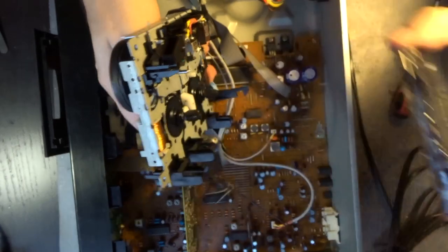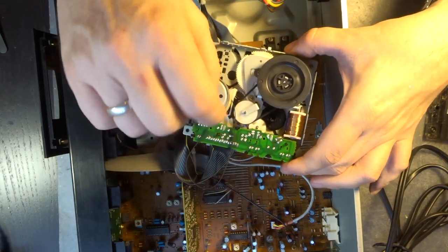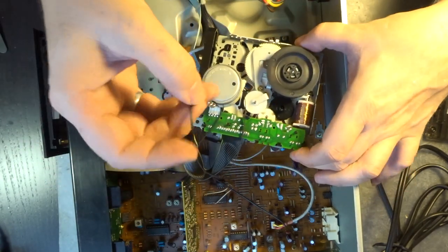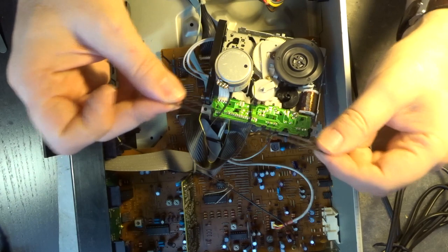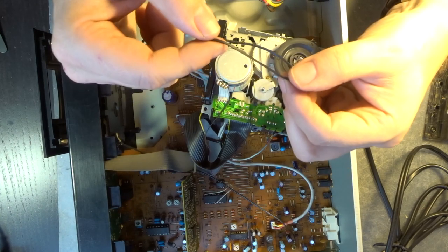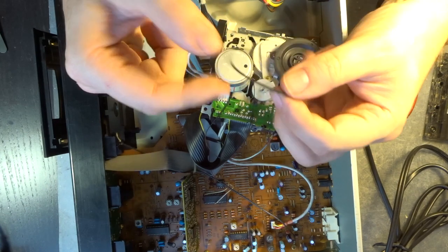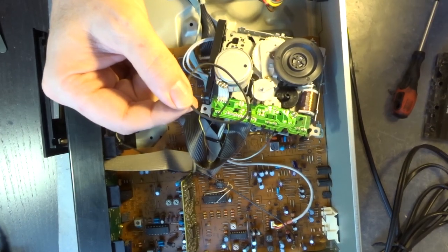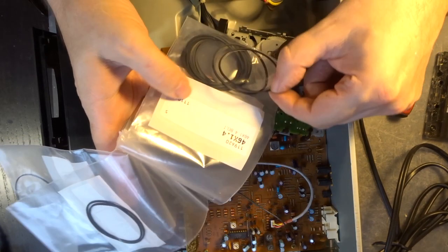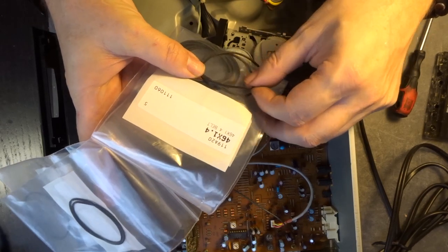Okay, so I have unplugged it again. Let's take out the tape. So that's the capstan belt, which leaves a good impression. And this is here the belt for the other functions. There's a bit of a chewy consistency. So let's get another one. Seems to be a 1.2, 1.4 millimeter square belt. So let's see if I got something that fits here. Okay, so I got this 46 by 1.4, and I consider that close enough. So let's give it a try.